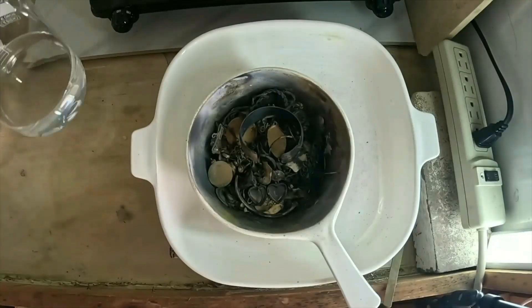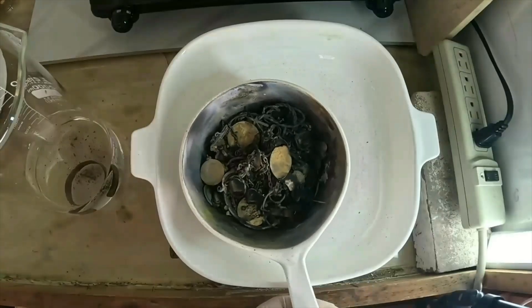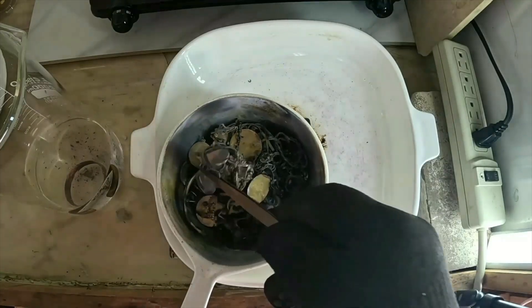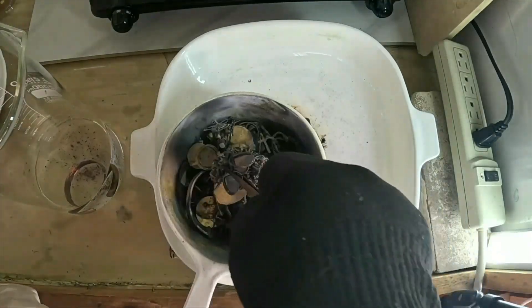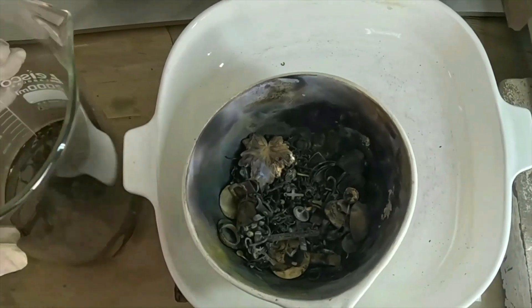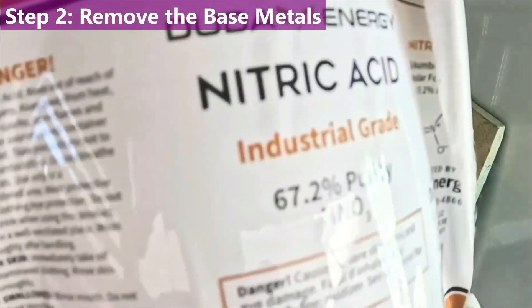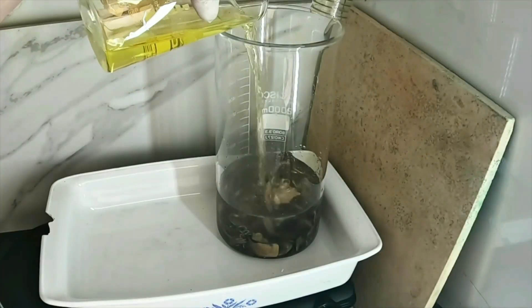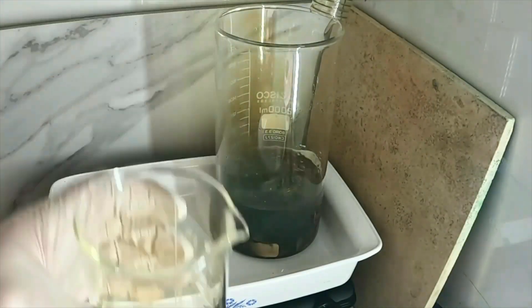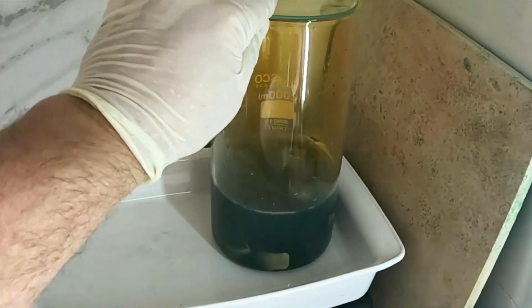Everything's burnt, there's no more smoke, and I carefully transfer this hot metal into our reaction beaker already filled with some distilled water. Adding nitric acid into the beaker will dissolve all the base metals, leaving the gold behind. In total this batch is going to use approximately 1.3 liters of nitric acid. I start by adding a little bit at a time to let that down — an initial boil-over is a real possibility.